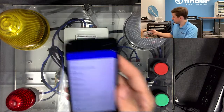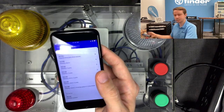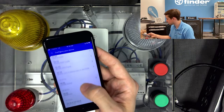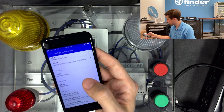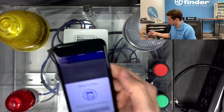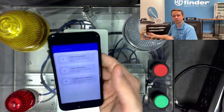I've switched my camera angles. This is a little rig centered around an 84 series that's going to turn on some lights, and we've got some signal push buttons. Let's start with the app. This companion app interacts with that NFC chip — we just select the 84 series timer and tap 'Read Configuration,' and then I have to make physical contact with the device.